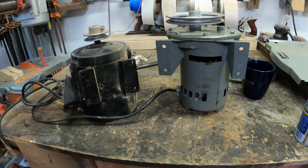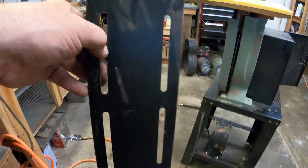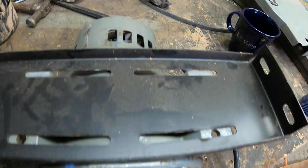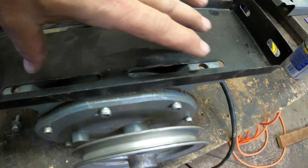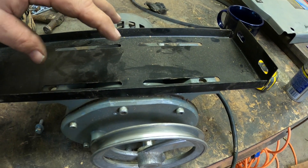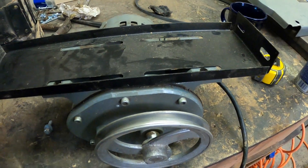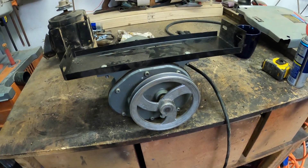I was hoping this was going to be easy. It was easier to just take the vertical piece that holds the motor out of the base of the saw — that piece goes in there and the motor just mounts to this face. I've got two holes that'll work, but the other two aren't there yet. I think what I'm going to do is use two bolts to get it mounted, get the tension right on the belt, and once everything's good I'll drill or file the other two holes so I can get all four bolts in. That gets us back in the saw.